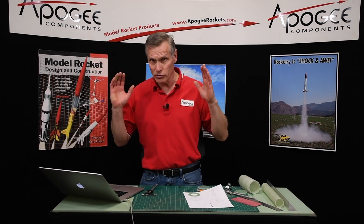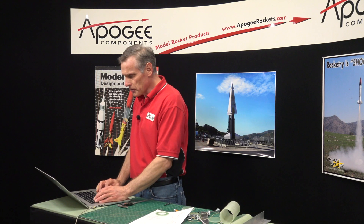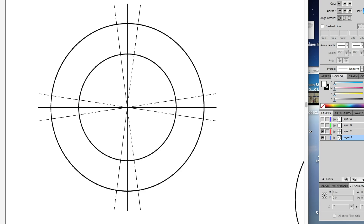You don't have to use eight degrees. You can use 10 degrees, 15 degrees — it doesn't matter. It doesn't matter where these holes go; they're only to allow us to pull that ring out the back. Then I drew a circle around the outside, and at the cross points are where my holes are going to go, and I just drew the holes in there.